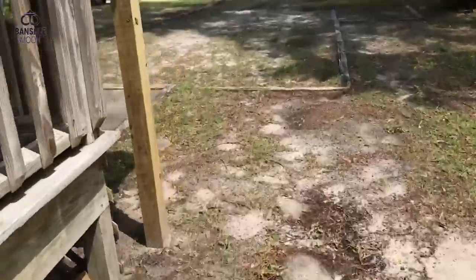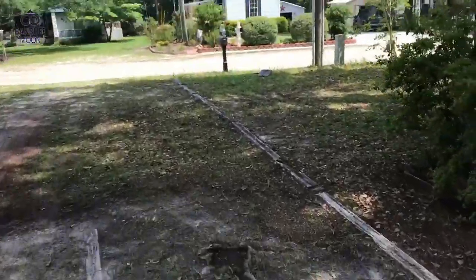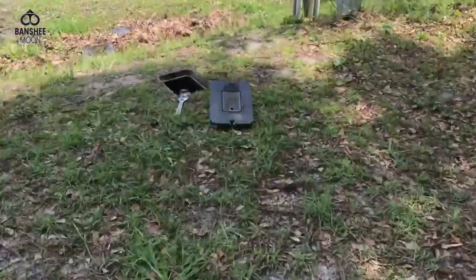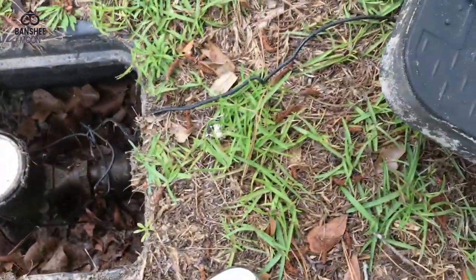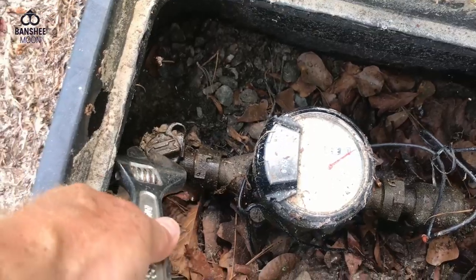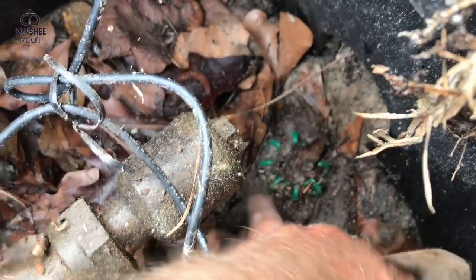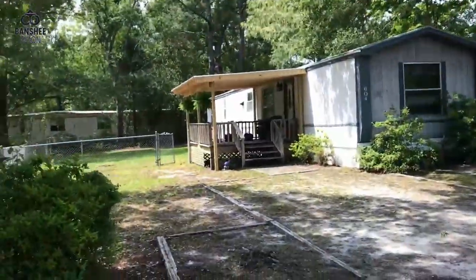And what you must do first, if you've never done this, is find your water line, your water main, which I've done here, and shut it off. I've had to do so with this. I use the main, that's the city side. You may also find, if you look, a homeowner side, and you'll maybe find a shut off there too. But that was easier for me to access. So I'll leave that open, water is shut off, back to work.